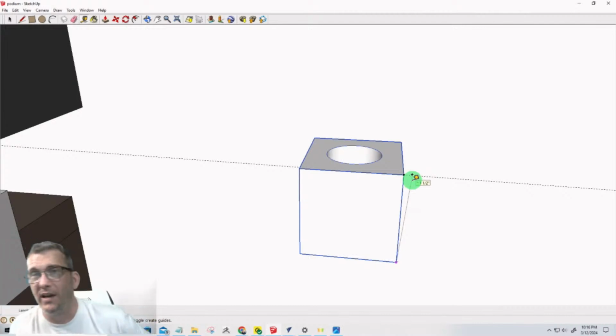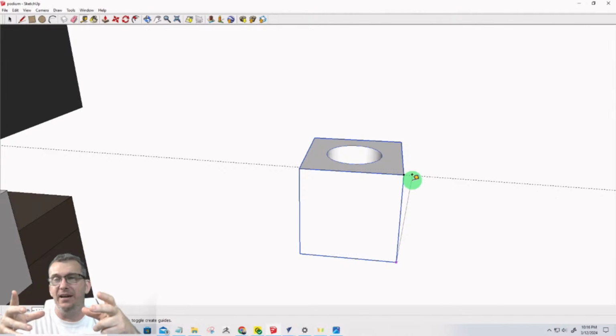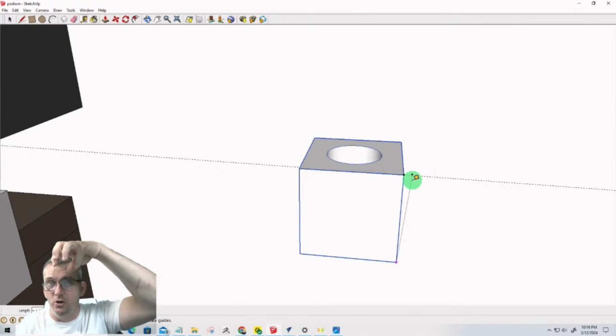Now, when we carve this, we're going to have this 1.5 inch by 1.5 inch by 1.5 inch square cube. We're going to have it positioned on the table. Now, here's exactly how I would do it. I would have a piece of MDF, 4 inch by 4 inch or whatever, with a 1.5 by 1.5 inch square cut into it for a nice friction fit.